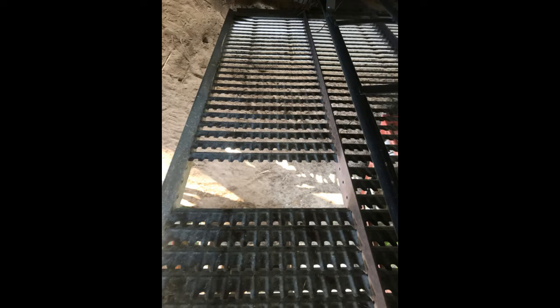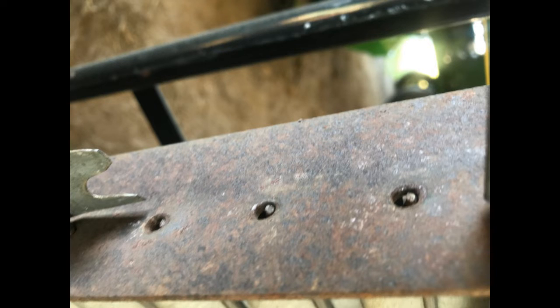Several sections of fingers broke loose from the sieve in this machine. It could be seen the wires holding the fingers were excessively worn. One cause of the excessive wear is bad bushings. It has been suggested these bushings be changed every fifteen hundred hours.